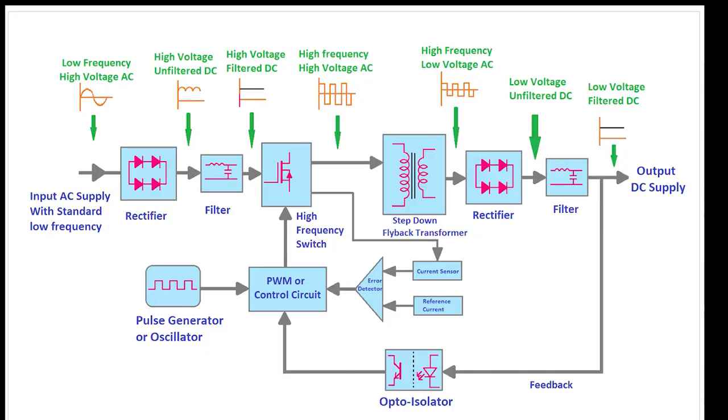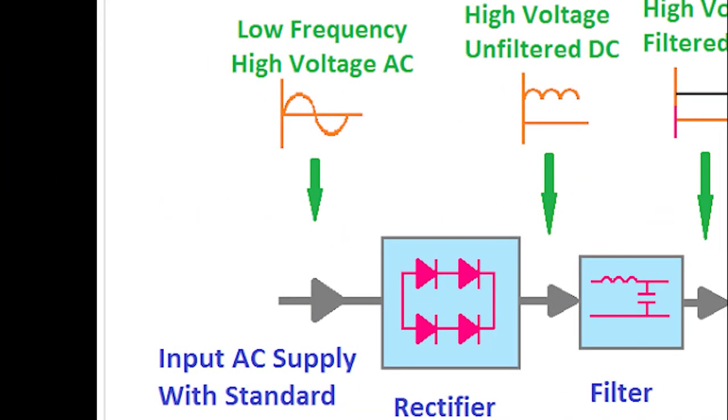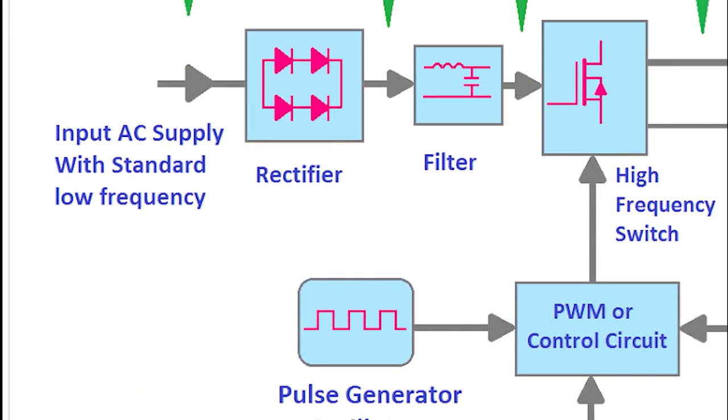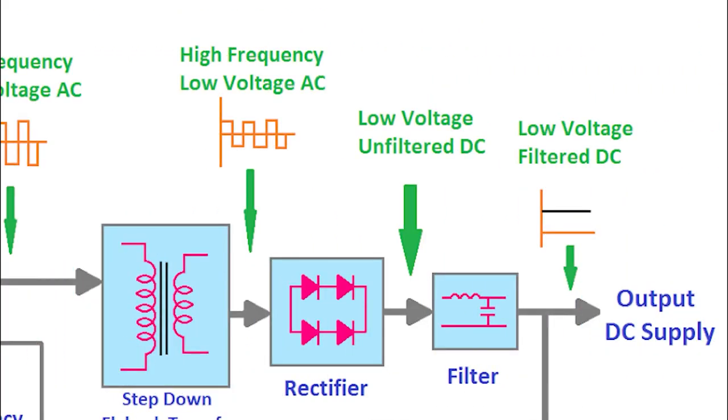Normally, an SMPS power supply has three main parts: high voltage section, low voltage section, and the protection circuit. The high voltage section starts with main AC voltage, which is rectified into DC with a high voltage filtering capacitor. After that, there is an oscillator circuit that divides the DC voltage into high frequency pulses to the chopper transformer, which works as a step-down transformer to give out the required DC, not filtered yet. Then other capacitors are chosen for the filtration of the output DC.